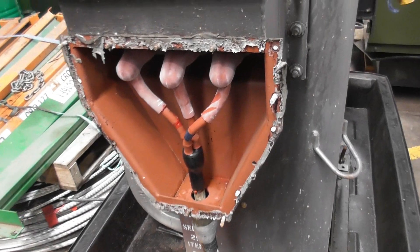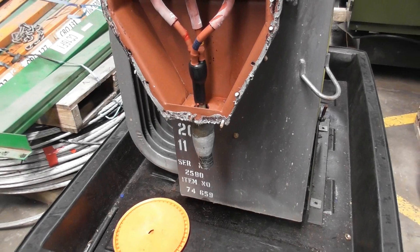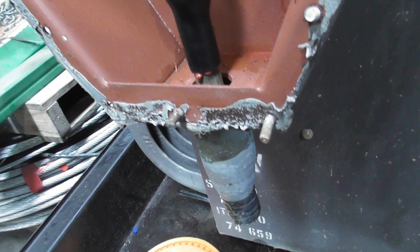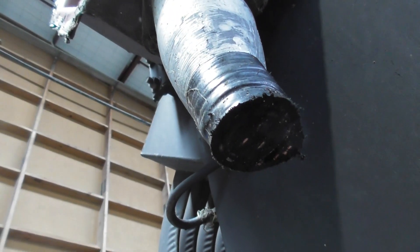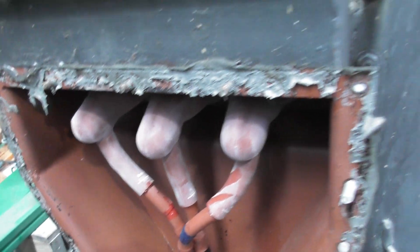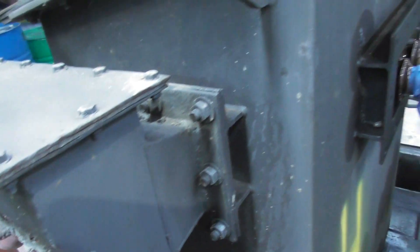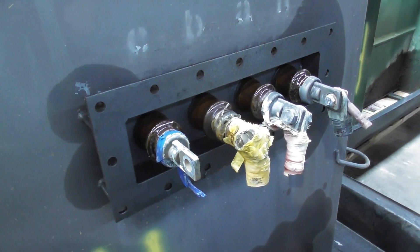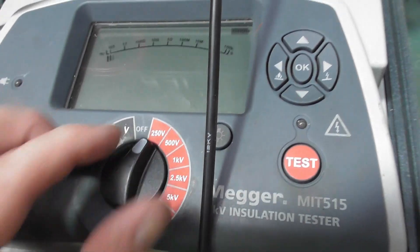And the HV is red, yellow, blue. We can't easily test this because they've got the cable and it's too hard to get good contact. I put a PK screw in there. I'll just do an LV test. I actually de-energized this device — I was involved in this job and it was in service, so this should be in good condition. LV running only on this one, 500 volts on the device.